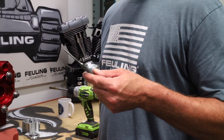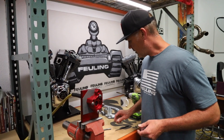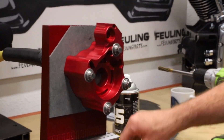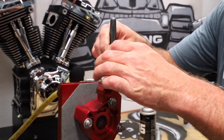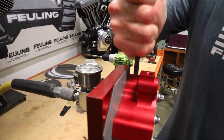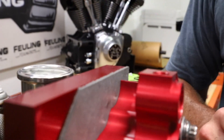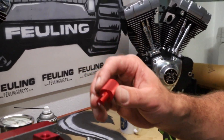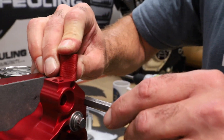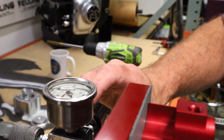I like to have an eighth-inch roll pin handy for testing so that you don't have to push the roll pin in and out each time. We're going to take a little bit of lubrication and spray that down into the bore, then drop the valve down in there. Just a little tap to help the seat on a brand new pump. The valve's in — we're going to drop the spring in. We also sell part number 9001, which allows you to hold the spring down and use your eighth-inch punch or the roll pin, making disassembly and installation easy. We're going to center the spring and then go ahead and see where we're at with this relief valve.